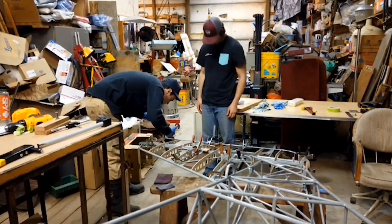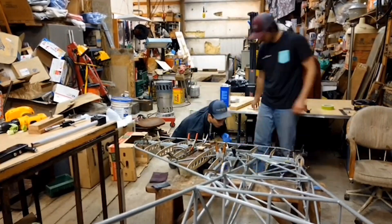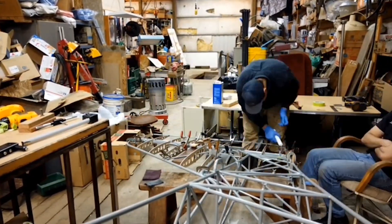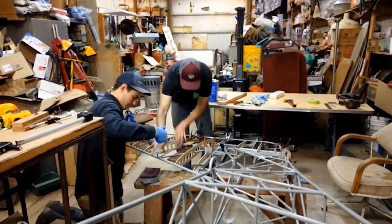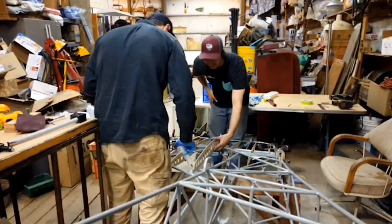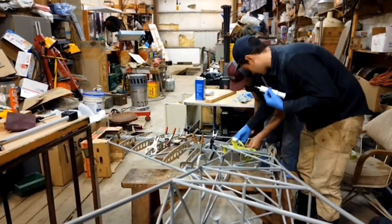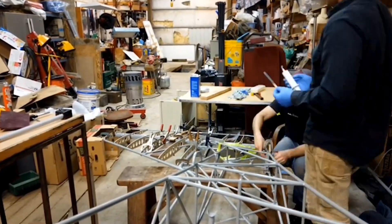All in all it's pretty good. We've been doing this for a little over a week and a half and probably have another maybe three weeks of work before I have to leave the project. Maybe we'll get the controls finished and the tail finished and then be ready to start the wings, but no guarantees. Everything — you'd expect it to take five minutes just to put something together, like all you need to do is slip this bolt in and slap these two things together. But if the manual says that, you can expect to add two hours of work, because nothing will fit right off the bat — you're just going to have to re-sand it, re-ream it, re-drill it.